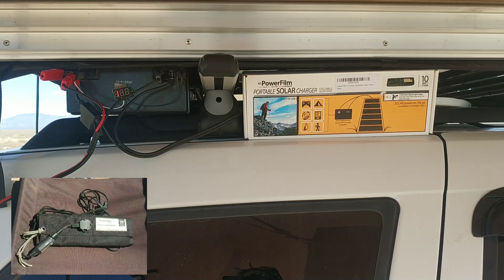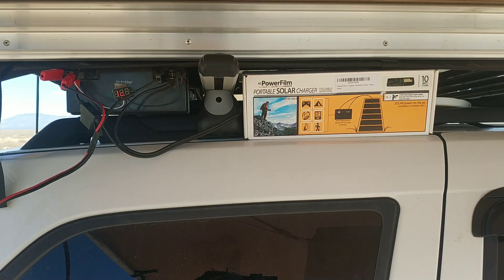The panel has done nothing but perform for me once I got it set up correctly. As with all solar panels, you want to make sure you have it connected to a charge controller and a battery prior to your load — I really recommend doing it that way for good, consistent results. I tried charging devices directly via cigarette lighter adapters to USB across 27 different models, and the results varied very greatly.